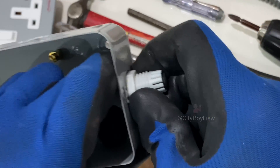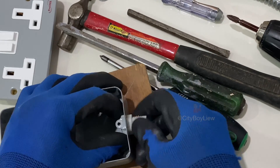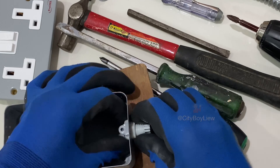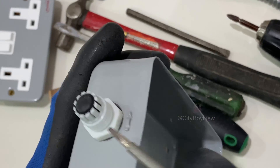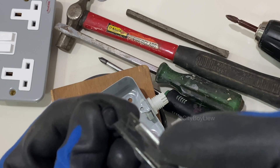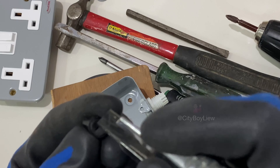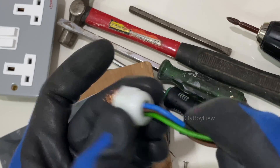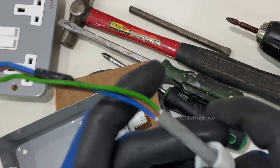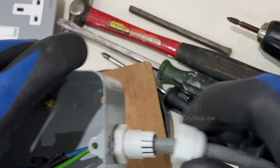Remove the nut and hand tighten it. This is not a waterproof cable gland — it is just bug proof, so bugs won't get in there. There's a rubber grommet — push it out and use a knife to cut across it, which allows the wire to fit through. Make sure the cover goes in first, followed by the rubber grommet, and fit it through.